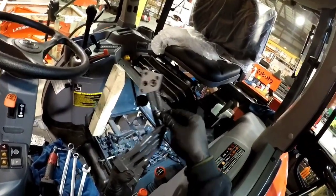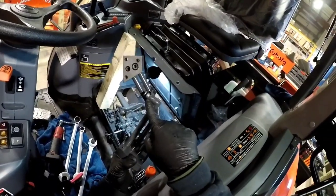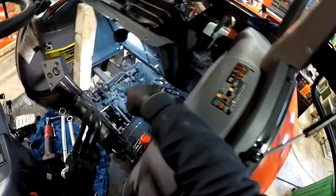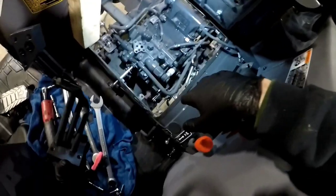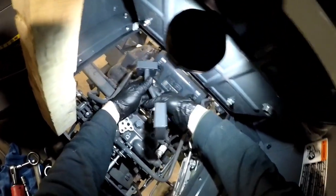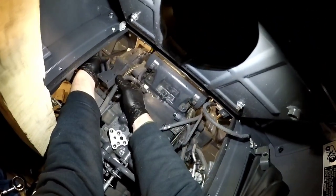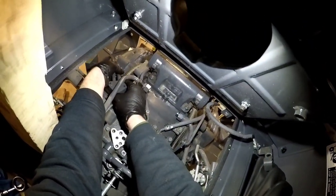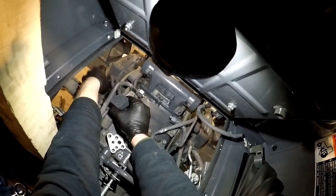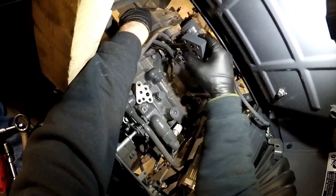We have our manifold here and the turn pipe inserted. To insert that into there is the same technique, which is more difficult. We'll stick to the more difficult stuff. We're going to go down here carefully without disturbing those O-rings on the bottom. Bring this baby up and in. It's your last time to check these O-rings. Still there. Give them a little squeeze.